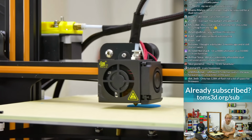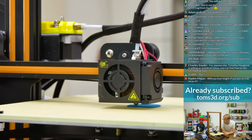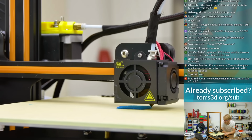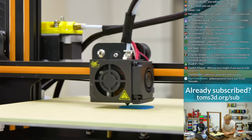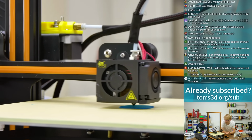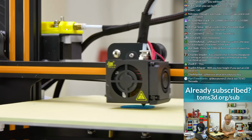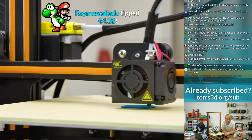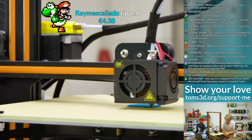I don't know what hardware is in here exactly. If it's a Melzi, it's going to be a super simple board. You should be able to reuse a few pins, like the Z end stop. You should be able to reuse that for a bed probe, so that is definitely an option. But I'm not sure if the Melzi will support any sort of dual extrusion.